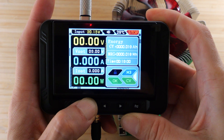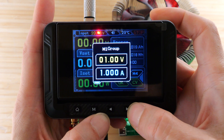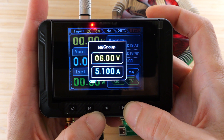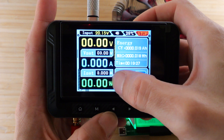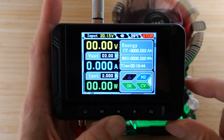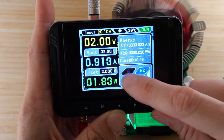There are six different preset modes that you can set the voltage and amperage. If I press and hold mode, we can access the mode group. I have set mode one to one volt one amp, two to two volt two amps, and so on until five. M6 group is six volts, 5.1 amps. So this gives you easy access to different voltages and currents. When you turn it on to one of them and want to change modes, it's going to turn off the output until you push the on/off button again. And now it's at two volt two amps.